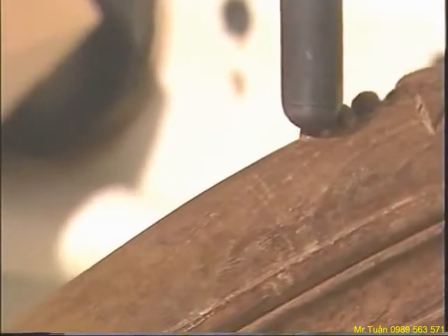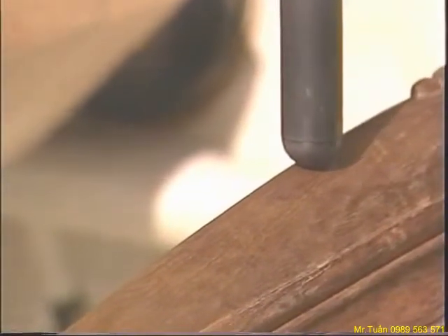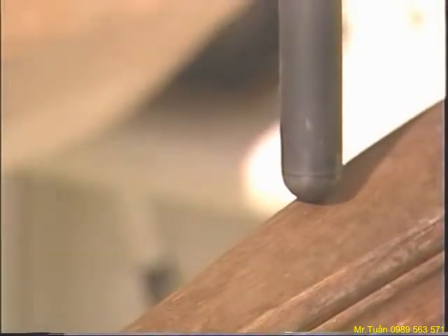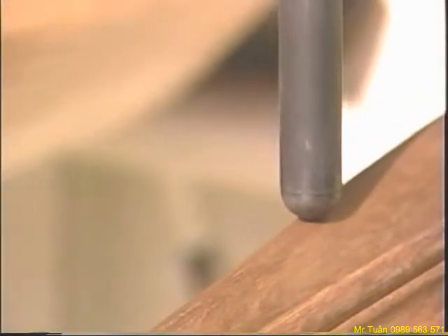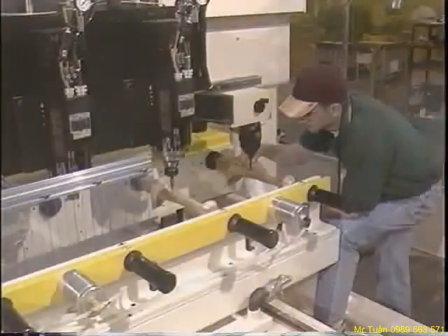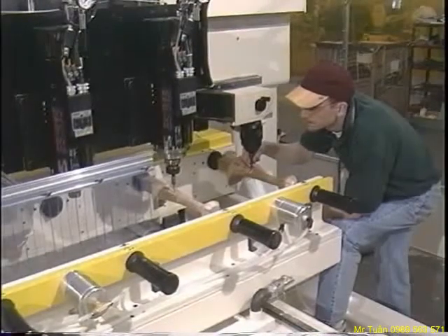The initial surface scan is an automatic process that uses a ball nose probe tip and cutter that travel the entire length of the part, shift over and return until the entire surface has been scanned. This can be run overnight to minimize production disruptions. Detail programs are developed using square bottom and linear probe tips and cutters.